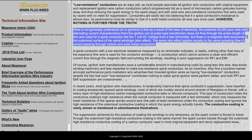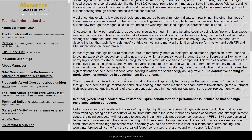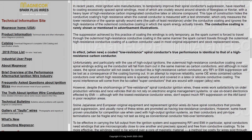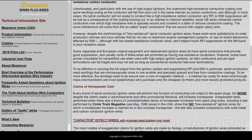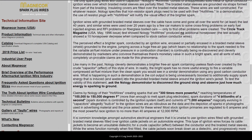The multimeter resistance measurement is useful, as I explained in my other video on replacing the leads where I had one failed, because you can use known specifications for your leads to check issues with yours. In other words, there's usually a particular resistance on a per-meter basis that you can check for.